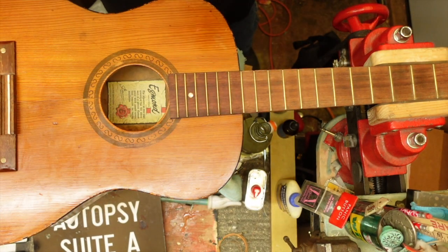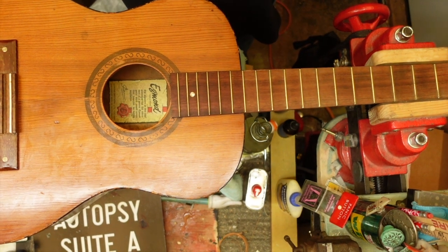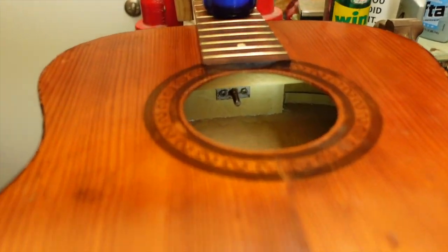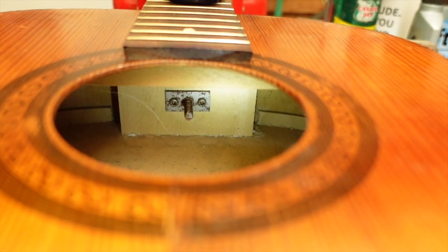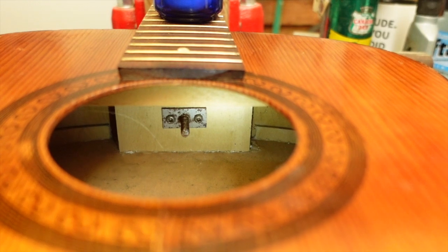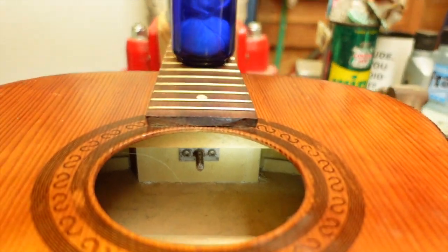Back to the French polish. Wait two or three coats a day - it's going to pay off for you in the end. Before we get too far, I promised I'd show you what that adjustable neck setup looks like from inside the guitar. It's just threaded, kind of like a T-nut that is stabilized, and the neck moves up and down in a joint that's tapered. That's what it looks like.